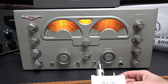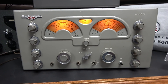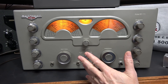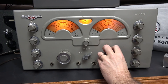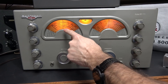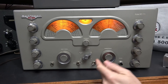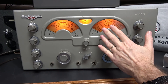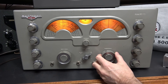The National 173 now has the D-Lab XCU-1M installed on the rear panel. I'm on 80 meters, and let's say I want to listen to the guys on the AM net at 3.85. You need to line up the dials — the dot shown is usually not very accurate, but with the calibrator you can get the frequency exactly where you want it. I'm going to put this dial right at 4 megahertz.